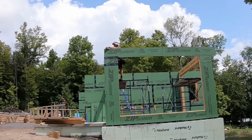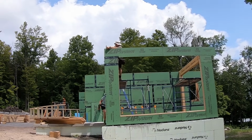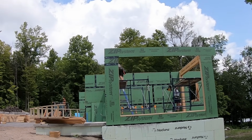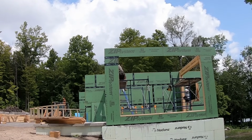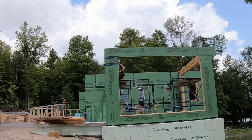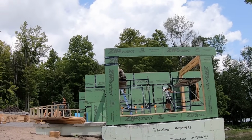With the scaffolding set up, I can then mark the layout of the trusses. This will help ensure the metal brackets are installed in the correct location. The brackets help hold the truss vertical and also provide that hold down strength to prevent any uplift of the roof system.